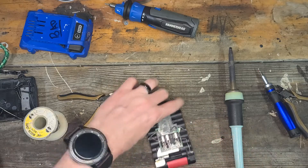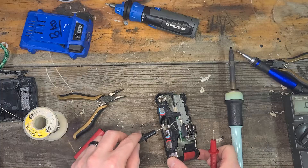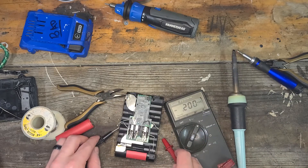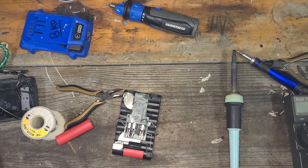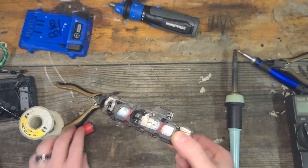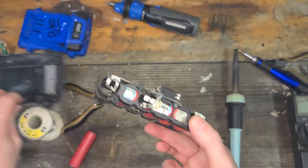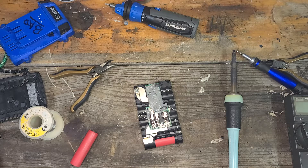If you want to check it to make sure the solder job is good — or at least connecting and getting some power across — you can touch off on the sides. I forgot this was the junk battery I just soldered back in, but I'm getting the same reading whether I touch off on the battery or not, so that's what we wanted. Assuming you would have put a good battery back in there — not a bad one like I did just for this video — this should have worked. You just have to do that two more times, or in this case six more times, and then you'd have a fully functional battery. Put it back in the case and that would be a good battery. Hope that was an informative video — if you have questions, let me know and I'll try to make another one. Thanks, see ya.